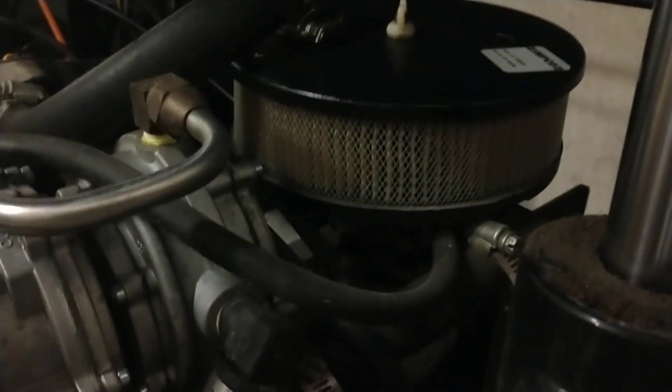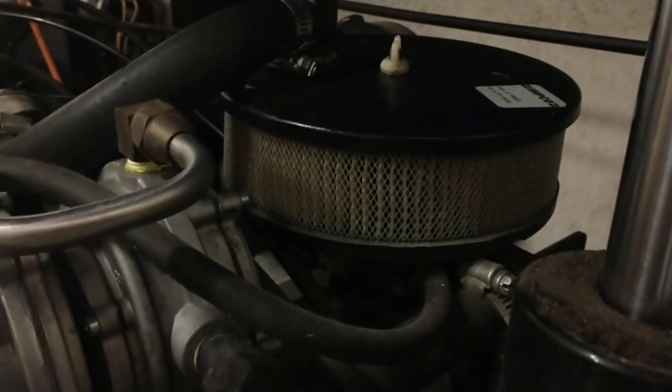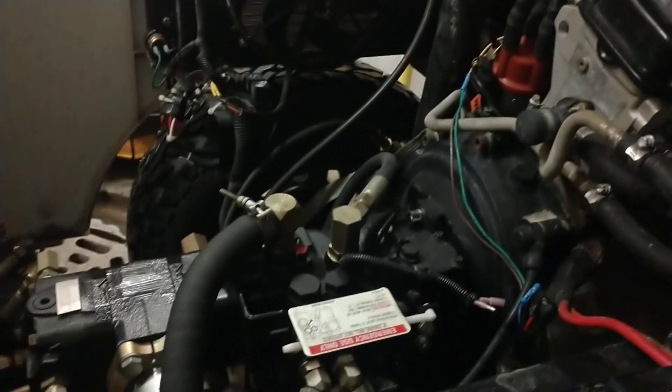It's got an air filter here. I'm surprised it didn't go for a K&N — anything besides a K&N or an Amazon special is just expensive and a piece of crap. Battery — it needs electricity. If you look at what's coupled to the engine here, you'll see it's got a pump. Believe it or not, all these wheels are not connected to the engine. It's a four-wheel drive system all over hydraulic motors, and it all runs off of this pump right here.